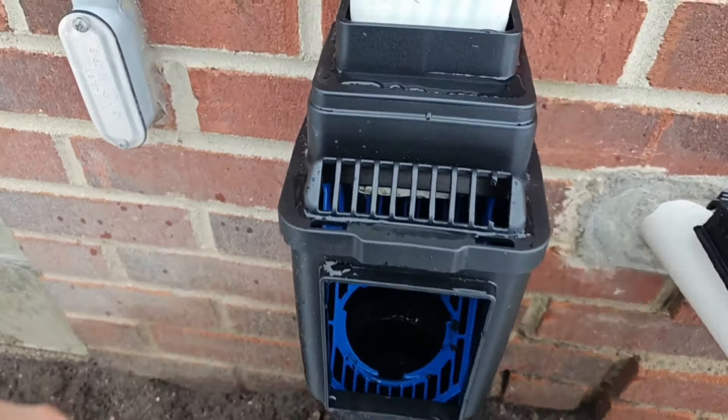Let me show you the proper way of hooking up this inline sediment trap. It's only five inches wide, it fits in your trench made by a shovel — super easy install. This holds one gallon of shingle gravel. There are some tiny little holes that were drilled. This is going to serve as an excellent inspection chamber. Easy to pop this little grate, even after the grass grows over the turf restrictor plate — super easy to pop this plug to do an inspection. I'll be able to see the fish tape and pull the wire through.